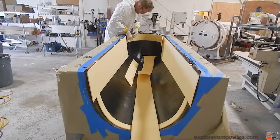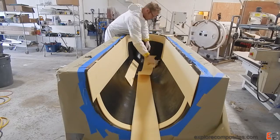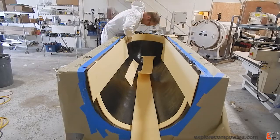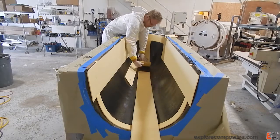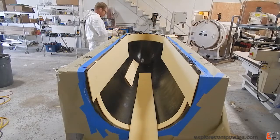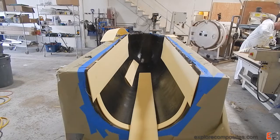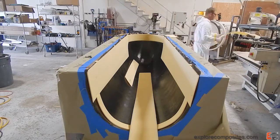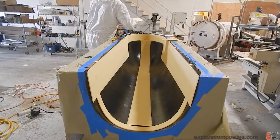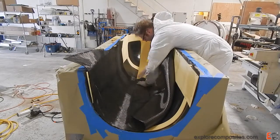Here's the core mostly in. The side panels are hanging off of little foam blocks — you can see a couple that are five minute epoxied to the panels. They just lip hook, hanging over the lip a little bit and helping things stay so they don't slide down into the mold. The center line core strip is just laying there, with the ones at the back and front needing a little fitting on the job. The compound curve areas are not cored because the curvature gives them enough stiffness — hopefully.